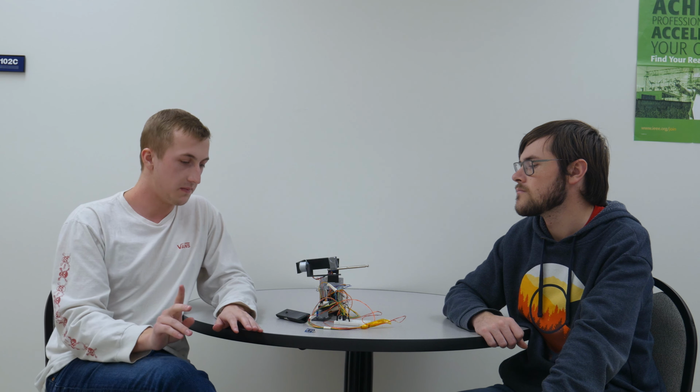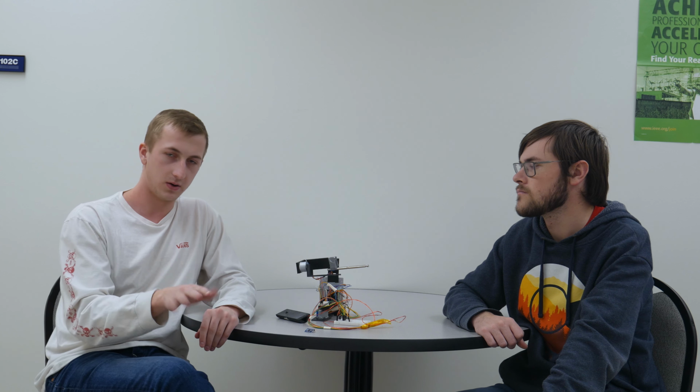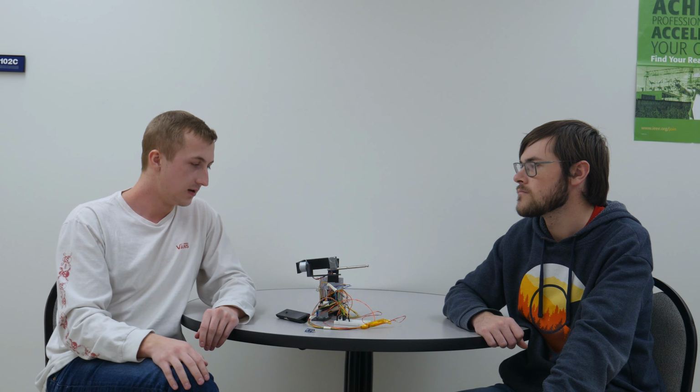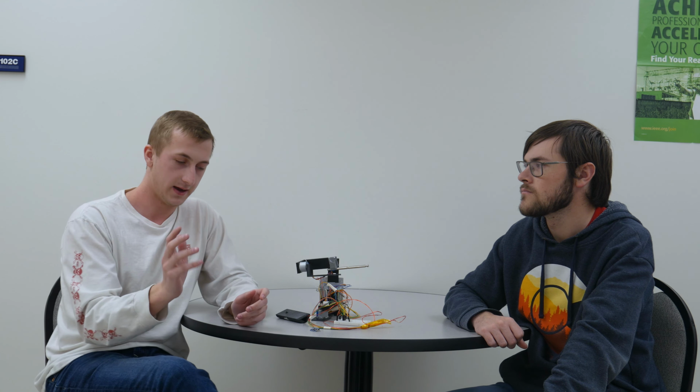We had this threshold value for one main reason, and it was to eliminate jitter, or just tiny little movements that made our gimbal a lot shakier and more unstable than we wanted. This threshold value would only change movement in the motor if it was a big movement instead of small little ones, which would make it really jittery and unstable.